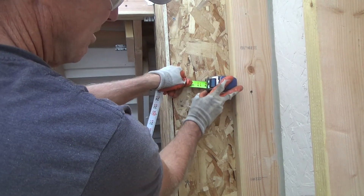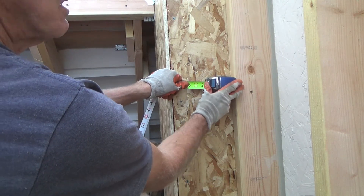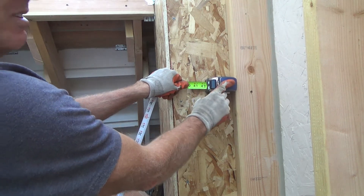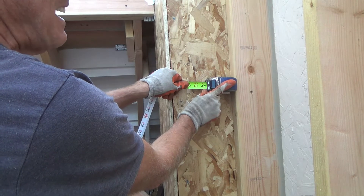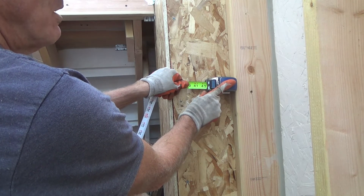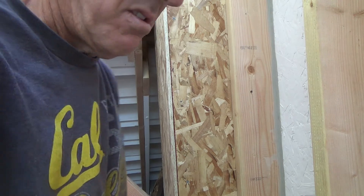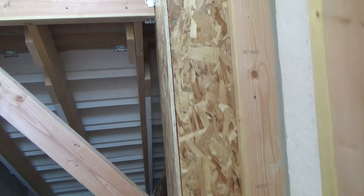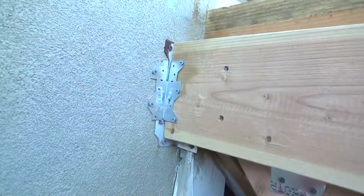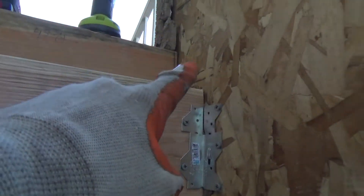42 and a quarter — where I could see that. Right at that point I add three and a half inches, because I know the tape is right in the corner. So 42 plus three and a half: 42, 43, 44, 45 and a half, plus the quarter — that's 45 and three quarters. I know that is the measurement: 45 and three quarters. That will fit between the stucco and the wood. I even wrote it down: 45 and three quarters.